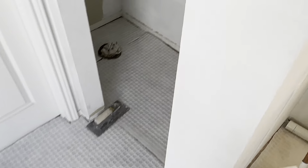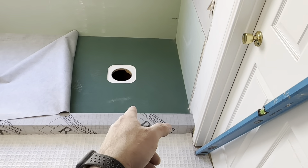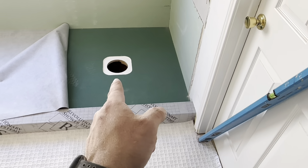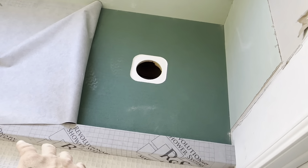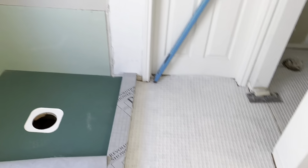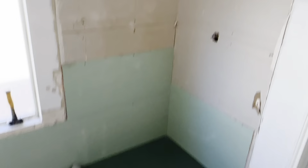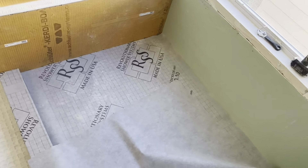Basically tomorrow we're gonna cut the old plumbing out, install the new plumbing for the shower, connect the plumbing for the shower drain, put the bonding flange on, then mud down the pan, mud down the curb, mud the waterproofing fabric over - maybe we'll have time to fabric the entire shower and put the bench together, and then we need to mud down the strata mat. That's a lot of work for one day especially when I'm by myself. RSS Revolutionary Shower Systems - my favorite, made in the USA. Check them out, see you later.